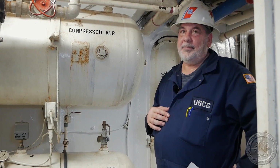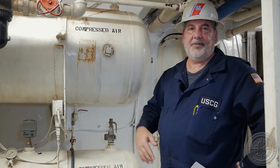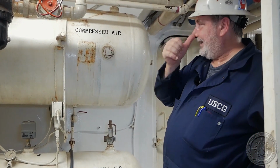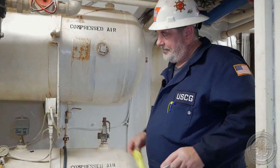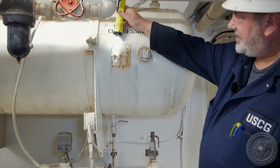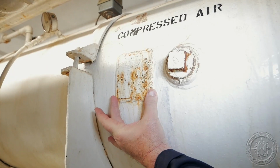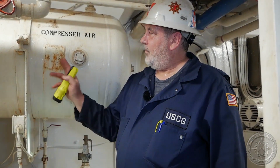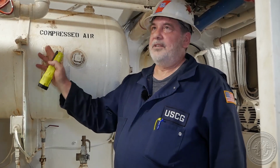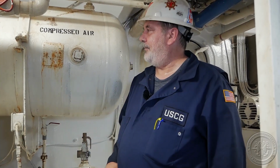The main requirement is that they be legible, and as you can see on these two unfired pressure vessels that have been out of service for 15 years now, that's not the case. They've been painted over, and this one is rusty. Sometimes you can take a flashlight and throw a profile to get information, but today that wouldn't work on either of these two plates. Another option is to get the vessel representative to bring a soft wire wheel that would remove the paint and the rust without damaging the letters that had been imprinted on the plate.